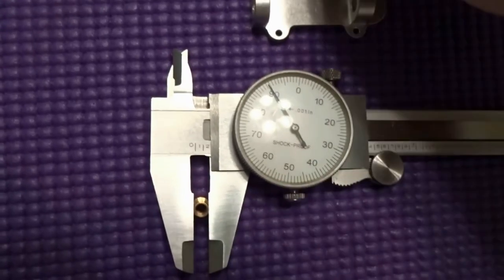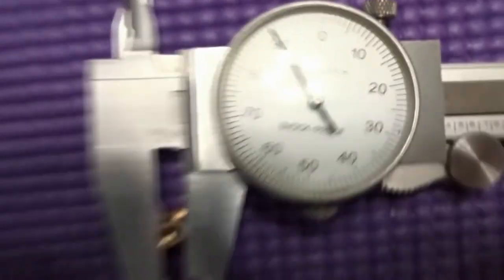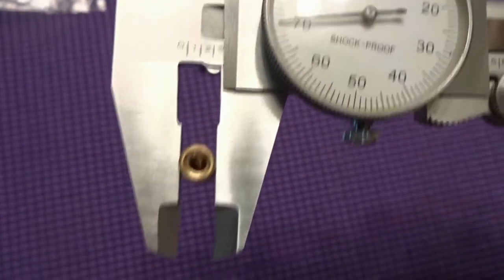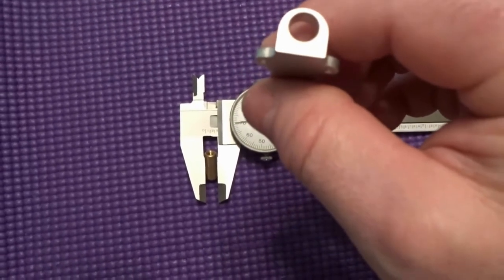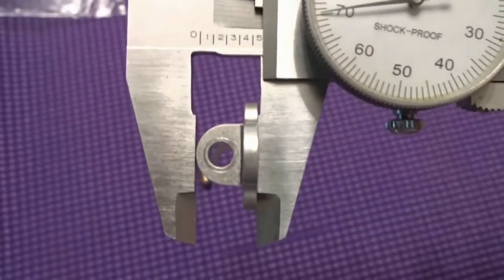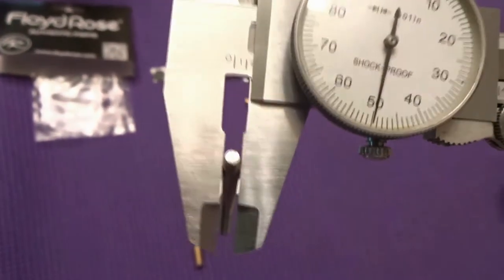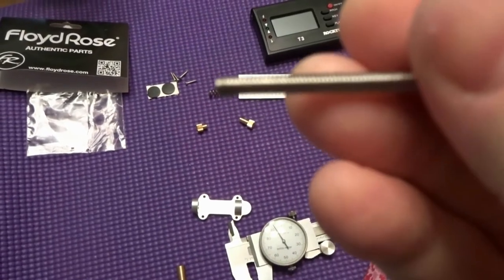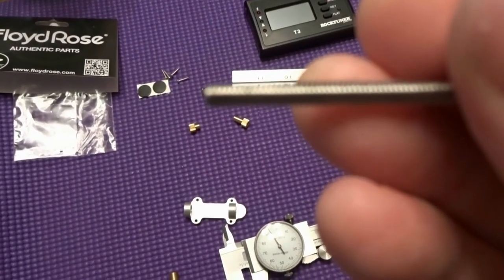The diameter of both outer parts is 190 thousandths of an inch, and the piston part is 270 thousandths — you'd drill that one to two thousandths over. The height is 470 thousandths. The thread diameter is 150 thousandths, and the thread pitch is 36 threads per inch, which works out to an 8-36 screw.